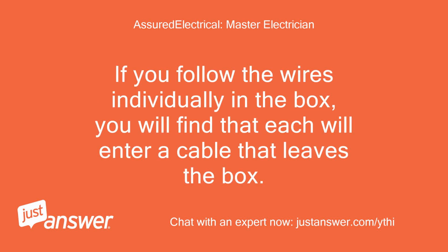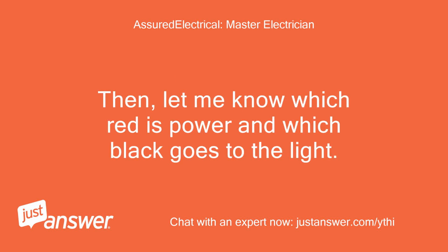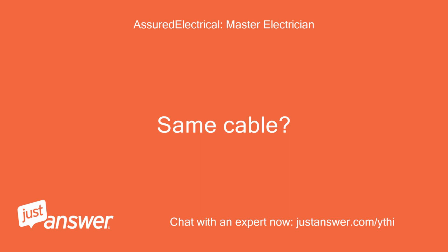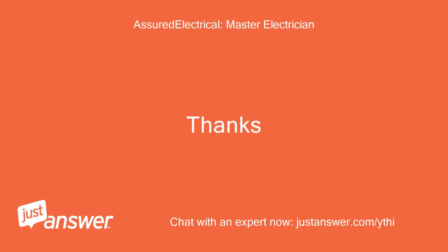If you follow the wires individually in the box, you will find that each will enter a cable that leaves the box. Pair them up, so you have a red and black from the same cable. Then, let me know which red is power and which black goes to the light. Same cable? Or different cables?